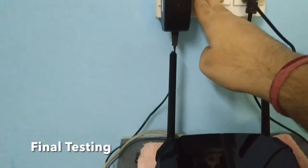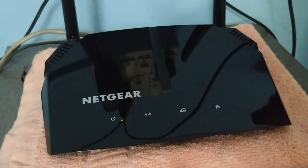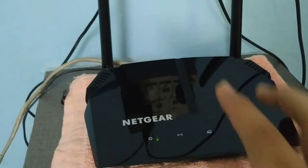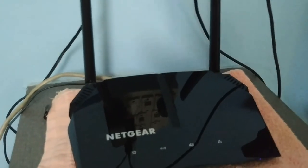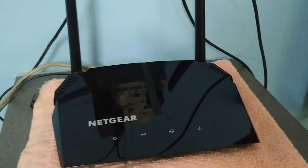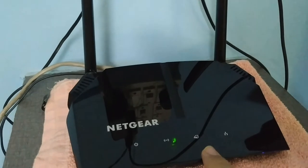Now let's test it in the real world. I've connected the LAN cable — the power is on. The problem was the moist dust acting as a short circuit in the power supply section. Earlier it was shorting the LAN and power supply section, and it got fixed with this cleaning method. Now the power supply section was shorting, so cleaning the dust resolved it. If you have a damaged component, try to replace it yourself if you know how to solder SMD components, or get help from a technician. You can also use flux to clean the circuit tracks.